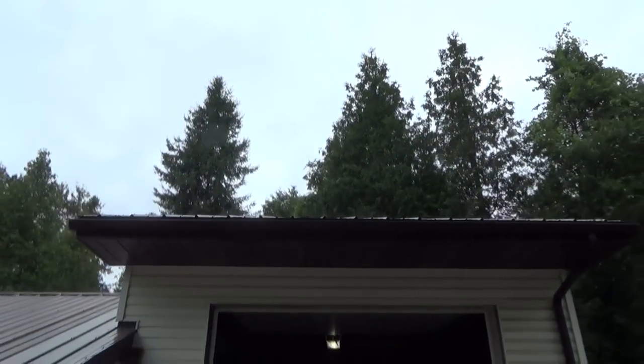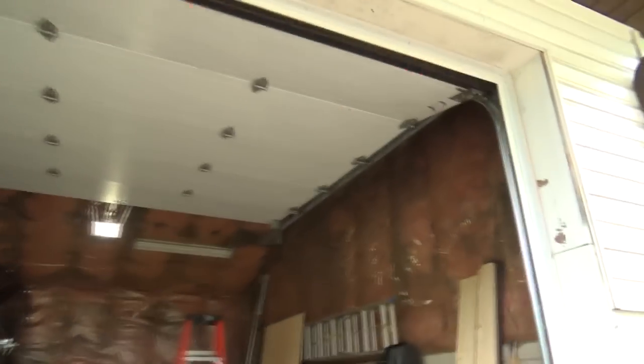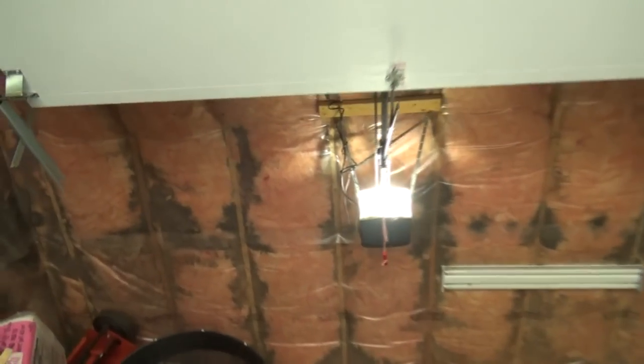I'm like, really? You know, so what he figures is happening here is it's sucking in moist air and stuff, and then it's condensing way up underneath the steel roof, which is, of course, up there. This stuff is condensing underneath of that and then dribbling down onto this stuff, and making it damp and a good moist area for stuff to grow on.